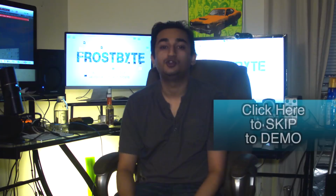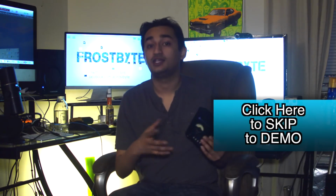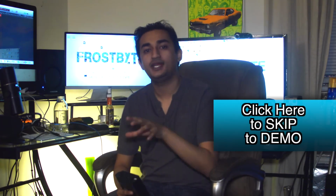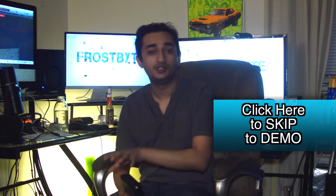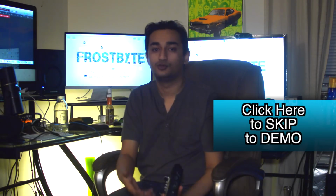When you're using a microphone, you usually don't have a vocal amplifier like you would for a bass guitar or a guitar. Usually those instruments have an amp, and an amp is a preamp and a power amp sort of put together. It is a preamp onboard EQ system where it'll take your line level instrument and put it through its onboard circuitry, and then the power amp will then take that and amplify the sound through a speaker cabinet.